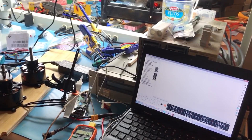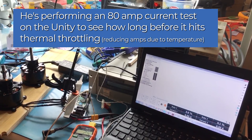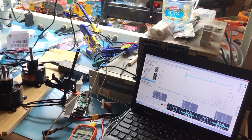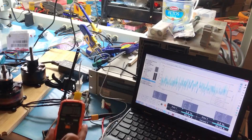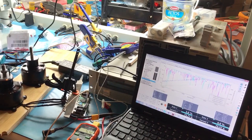Welcome back to the shop. I'm retesting, revisiting the 80-amp test that I did previously. Open the 80 amps contact and we'll just see how long it takes to hit the thermal throttling. Right now Fet1 is at 54, Fet2 is at 53, climbing. The case right now is at 30. Now Fet1 started to throttle a bit, and you can see it's going to catch up to Fet2, and Fet2 is throttling now also.